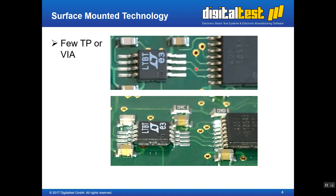When you don't have access for a test point or a wire, that net normally has no access with a circuit test fixture nail. We have a large customer in Japan who does mass production with fixtures that probe directly onto SMD component pins. Here is an example of an SMD component where probes can be placed onto the pad area.